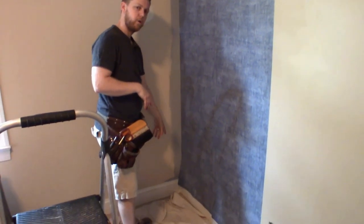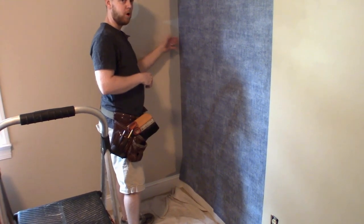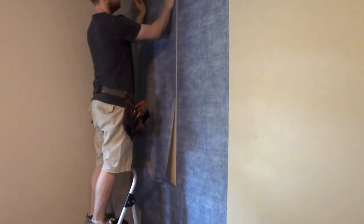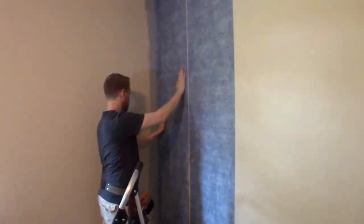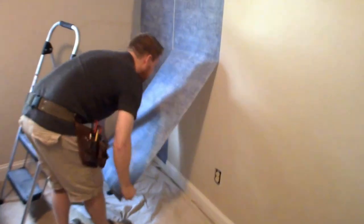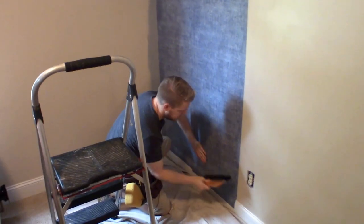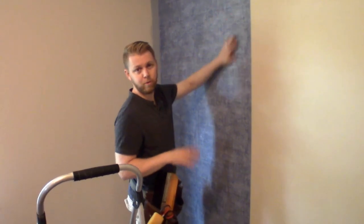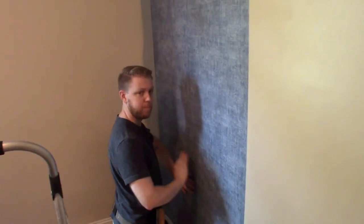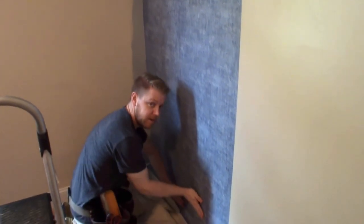The top of our wall looked really plumb so we hung the top, but as we worked our way down we noticed about a quarter-inch gap between the perpendicular wall and the edge of our wallpaper. Rather than moving forward, we're going to pull the first piece off, overlap it onto the perpendicular wall a little bit at the top — the amount we need to fill the gap at the bottom — and then trim off at the top. Let's check plumb one more time to make sure we're okay. We seem to be good, so let's keep going.